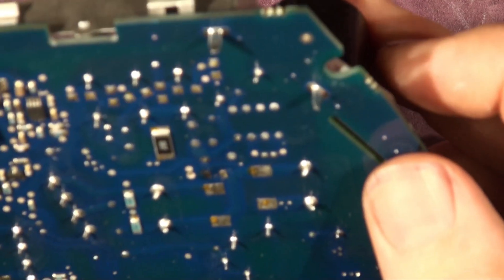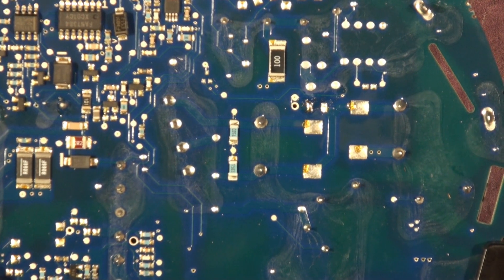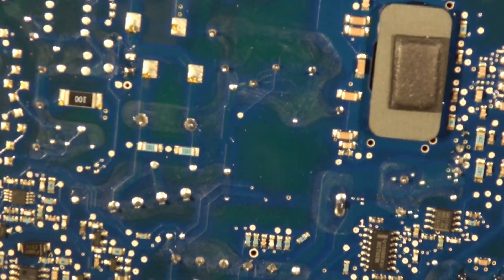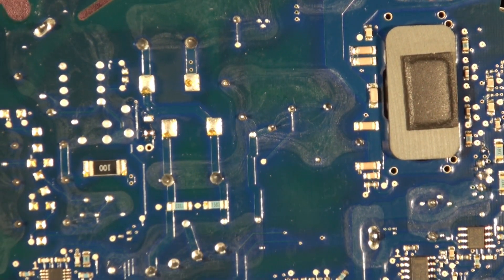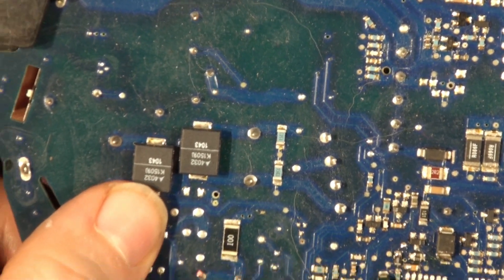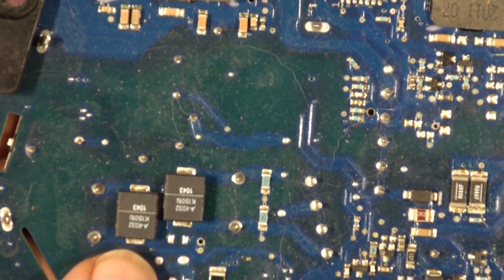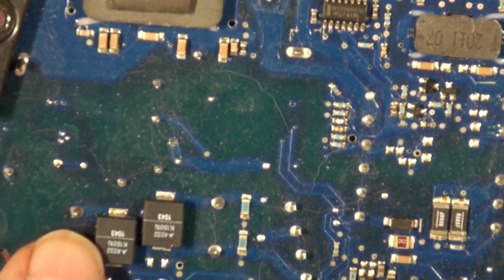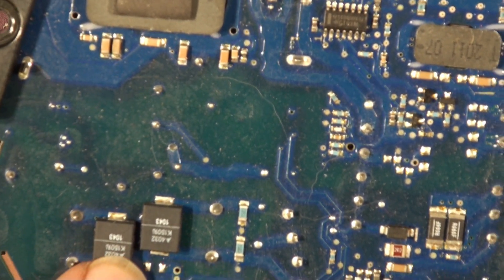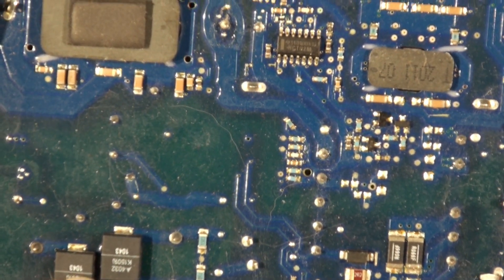The only other thing to check: on the back, there are varistors which actually limit the capacitor voltage. They are normally populated across here — there are two varistors. On the 220-volt version, you've got these two varistors — they are voltage-dependent resistors which start conducting when the voltage goes high. The idea is to balance the voltage between these two capacitors, because they're running in series there's nothing to regulate the voltage on the centre point. Most companies just use a couple of resistors in place of those, but Bose prefer to use a varistor.